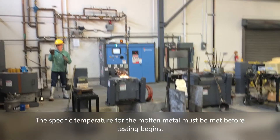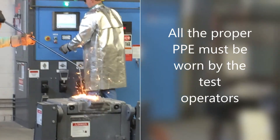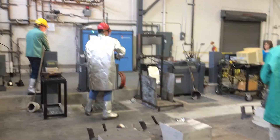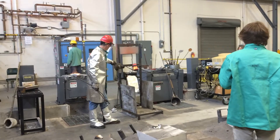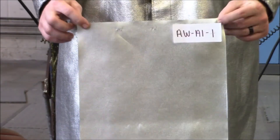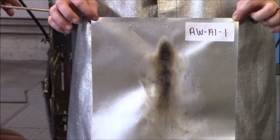The testing process begins with the technicians safely bringing the test metal to the proper temperature. Test technicians must wear proper PPE while doing the testing. The test operator then takes the crucible and places it in the test stand, which is calibrated to pour at the proper rate, and then pours the test metal onto the sample placed on the sample board. Typically, every test video is recorded to document the materials, the pour, and the visual results which are apparent in the testing process.